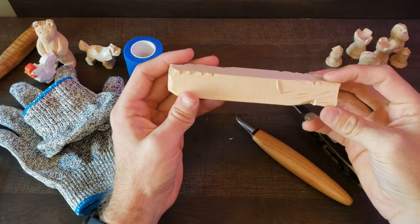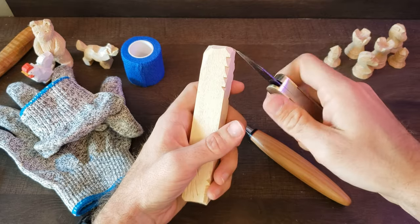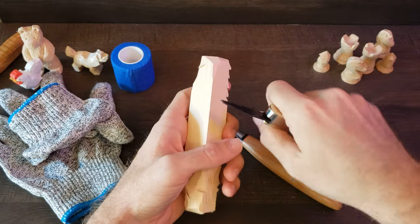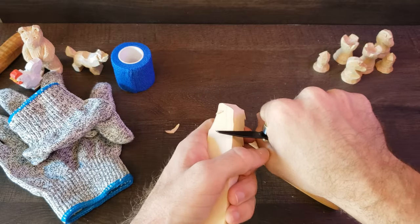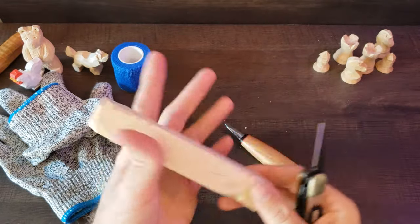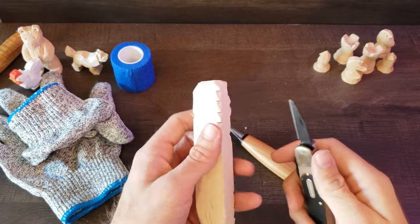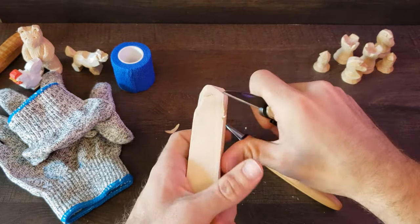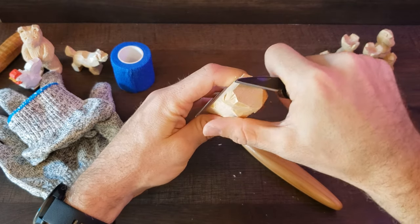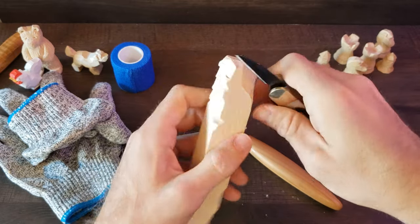Another aspect of safety that doesn't get discussed a lot is having the right technique. There's certain things you never want to do, such as pulling towards you in an uncontrolled way where you could easily slip and cut yourself. The same is true going the other direction — if you're holding your knife and going with the grain, wood can split in ways you don't expect, and you could injure your finger or break off a section you didn't intend to. So work on your technique. If you cut towards yourself, use a very controlled paring cut, work in a way that keeps your thumb out of the way, and always use slow, small moves.